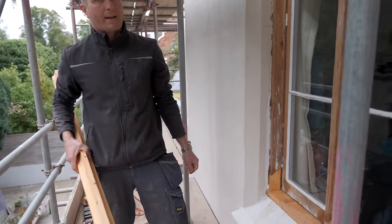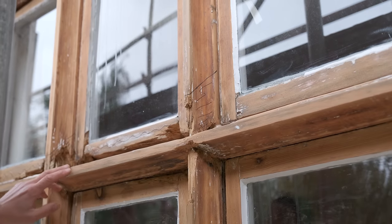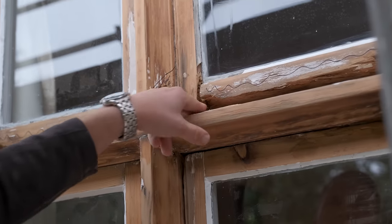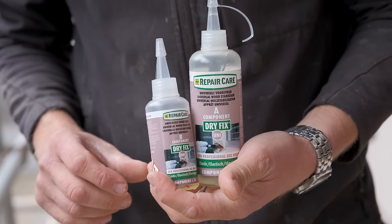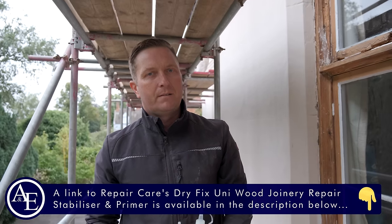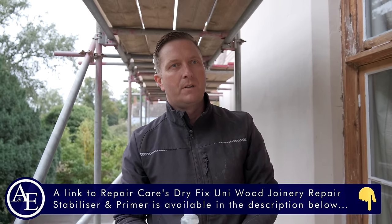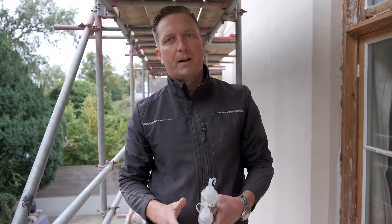When I come back I know what I'm dealing with, and I will mark out what I'm going to cut and what I'm going to keep — anything that might appear flaky and nasty underneath. So this piece will probably stay. It gets treated — it's a two-part system. It gets mixed up in equal measurements and painted on the rotten timber. It soaks in, and once it's gone off it's harder than it was originally. Because it seals it, water can't penetrate again so it won't rot again. It also gives something for the two-part resin system to key to, meaning it never cracks and moves so you don't get water back in — which is what started this problem in the first place.